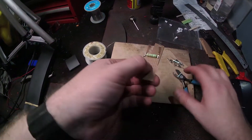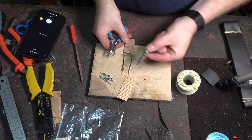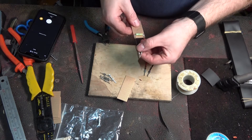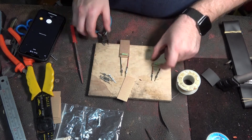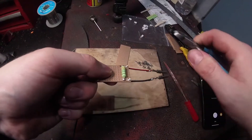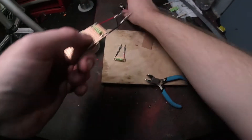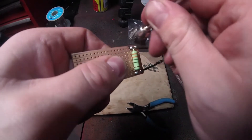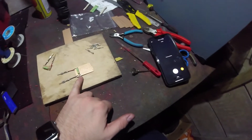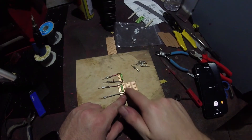As you can see, it's exactly the same, just bigger. I've made these leads longer because I made them too short on the prototype — it would be okay to slot in, but I wanted more movement so it wasn't under strain. We have these like this. Just going to trim that off the top, trim that one off the top. Clean it up with a wire brush. Now I'm going to have to split the actual little board we need off of the big board itself — this is quite tricky because it's quite a fragile board.